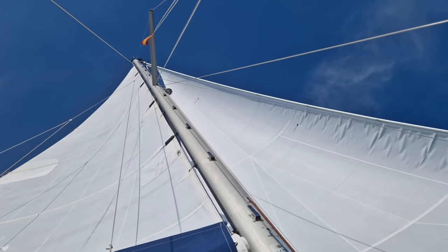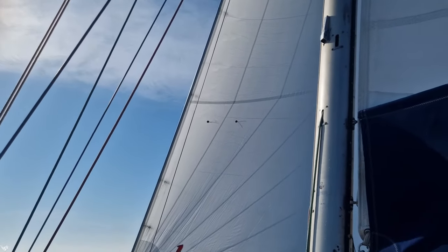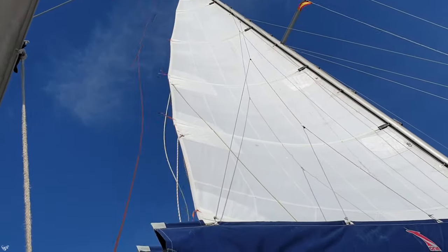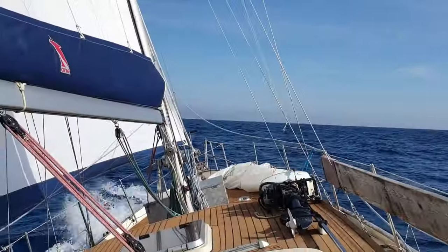The first thing is simply to get your sails up. I did this already. I'm under full sail — full genoa — and the mainsail is in the first reef. I did that because I expected the wind to pick up once further from the coast, and then it's a little bit more difficult to explain everything. So it runs pretty well.